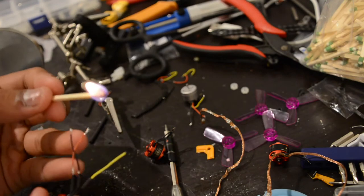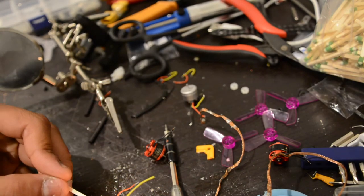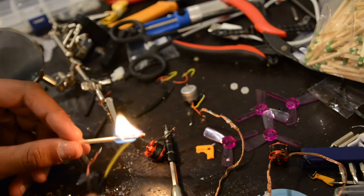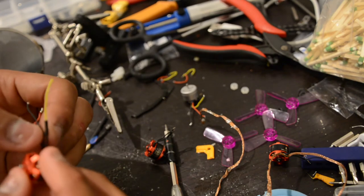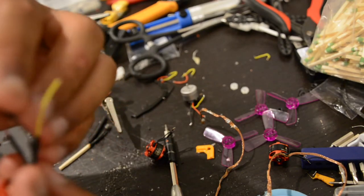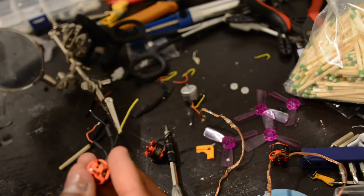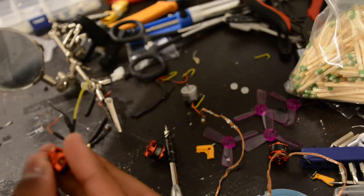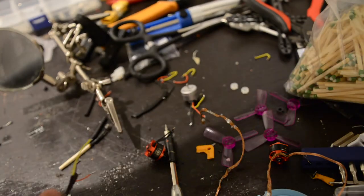You have the lid here — line up your heat shrink. Don't hold the heat too close to the motor; you obviously don't want to demagnetize anything. If you put the heat shrink too short, it's always a good idea to just grab a second piece — it's both OCD and functional. The less exposed contacts you have, the lower the likelihood of significant damage to your quad.